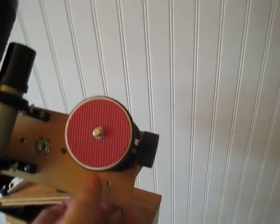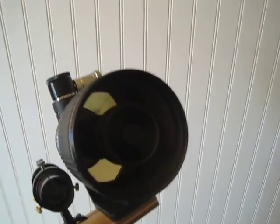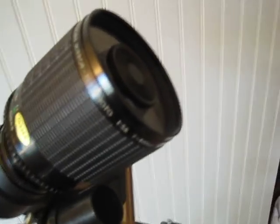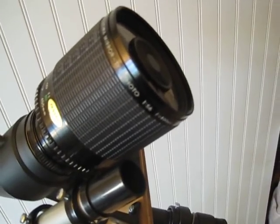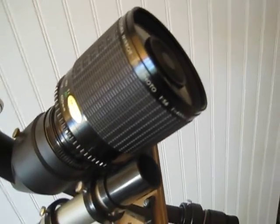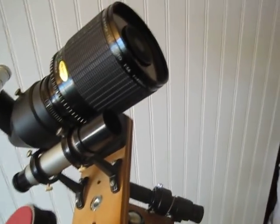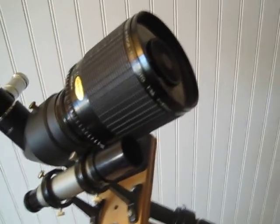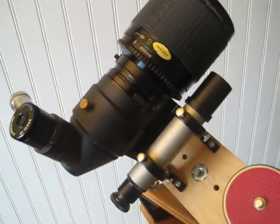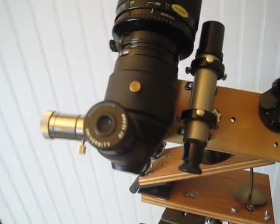This particular lens is a 400mm — obviously a mirror lens, 400mm f/5.6. I've used this one quite a bit, and you can see examples of what this lens can do if you go to Flickr and search 'astro kits' — you'll come up with still pictures of this arrangement and some of the photos I've taken. This drive will work with the 400mm lens, but with the teleconverter it brings it up to 1200mm, which is really pushing it. For test purposes it's good.